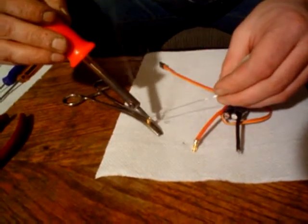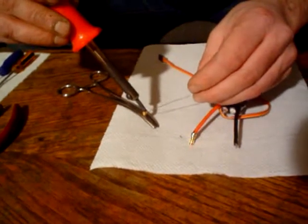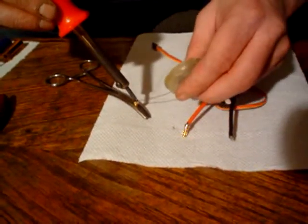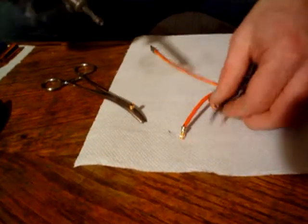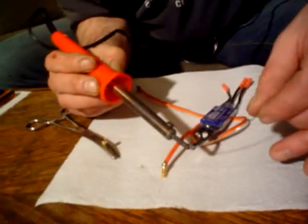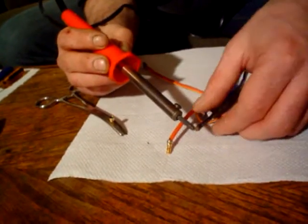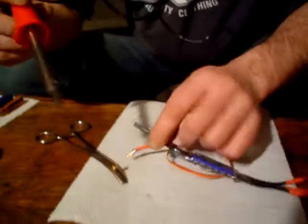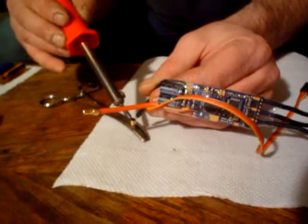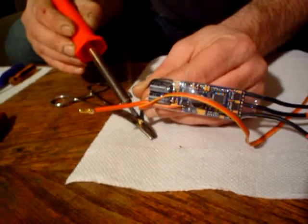Again, we're going to go ahead with this one — put a little heat on it, get some solder down in the hole. It doesn't have to be a great deal, but enough to fill it up about halfway. These connectors are a little fussy and you're always going to get some solder on the outside edge — it's kind of a pain. They're not easy, but anybody with a little experience will probably be able to do it no problem. The hardest part of this whole job is getting these contacts to go into that little blue pocket.